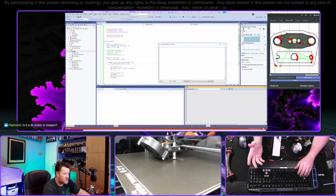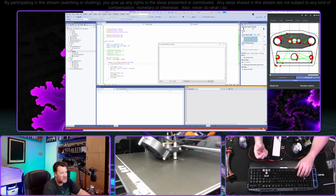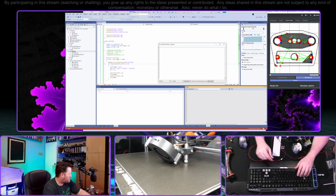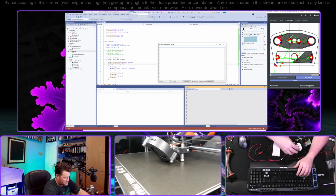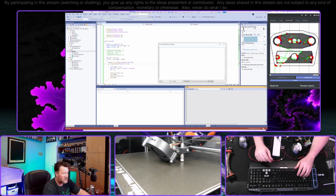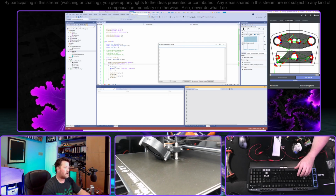The Toyota boy actually is the one who suggested this motor. It's a motor with a gearbox that's small enough to fit inside of this pop bumper, which is incredible. I bought a couple of really, really tiny steppers, but as he kind of pointed out, the gearbox gives this thing a lot of torque, so it feels very much like a servo torque. Whereas those steppers, I have no idea what their torque is, but they're apparently made for adjusting camera shutters in phones and stuff like that. So I would imagine it's pretty low.